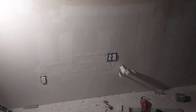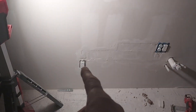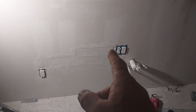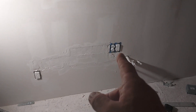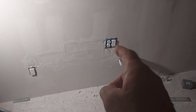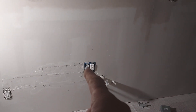A little video for self-documentation so I can look at this in the future and not forget how things are wired. The light power is coming up to that switch, going to that GFI. That should have been a double but it was a single. I ran a line over here to energize that outlet. This GFI is going to be for the garbage disposal, which is on a switch up here, so I couldn't just power from that over to this to make that hot.